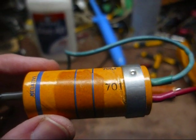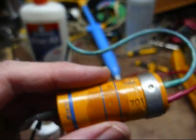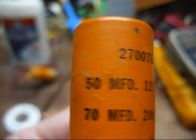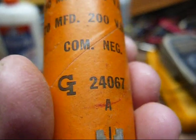Most TV shops would have told them to throw it away and go buy a new one. What he has in here is a Sprague electrolytic — 50 microfarad standard 50-30 at 150, like you'd see in a five-tube radio. I'm trying to find a date code on here. 701 — that could either be 67 or 77, but I'm thinking more like 67. I think the ones from the 70s and later had a plastic jacket on it. This one's cardboard, but we don't know when it was actually installed; this part could have been 20 years old when it was installed. Now let's see what the original is supposed to be: 50 at 125, 70 at 200. So I'll probably just go with a 68 and a 47 to replace those values.